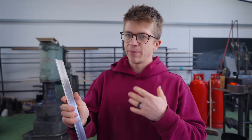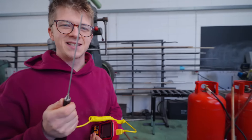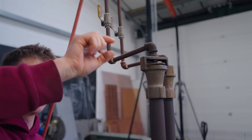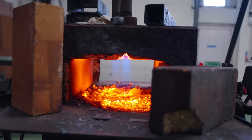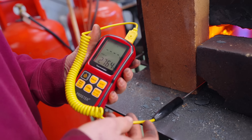I've decided that instead of cutting out the blade shape and grinding the bevels before heat treat as we often do, I'm going to do it after hardening. This stainless steel can be oil hardened and doesn't require a cryogenic treatment. The specs state 1050 degrees Celsius, held for five minutes. I bought one of these thermometers with a good long probe — we're going to shove it in the fire, find our temperature, and dial it in perfectly. This forge has venturi burners: gas forced through a tiny nozzle sucks in air, mixes, and creates the flame we want. By gently adjusting the mix up top we get a fairly accurate temperature, and it's all helped with my handy dandy tube trick. Slow and steady — 1050 is the goal.